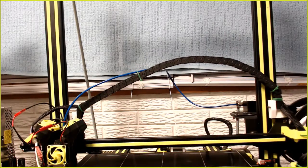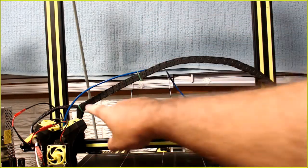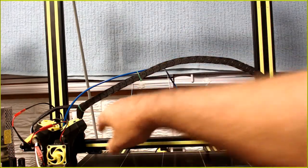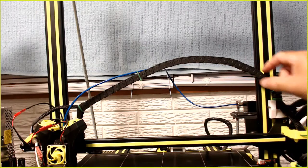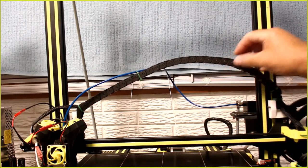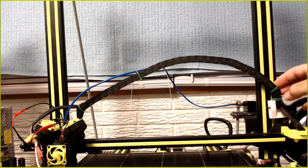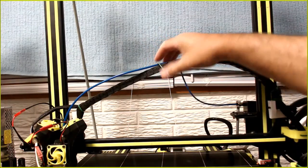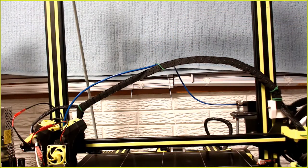Back and forth, no unnecessary bending. There is still a bend point here but it's a very gradual, easy bend. You can see I've got zip ties on either end because the little clips that hold the cable chain together are pushing against it pretty hard and keep popping out. So I zip tied the two ends. Again, the one on the bowden tube end isn't even tight - it's made so it can float around. Yes, my bowden tube's a little long - it's genetic.